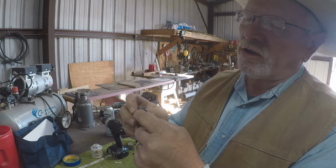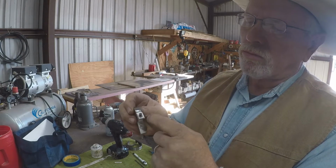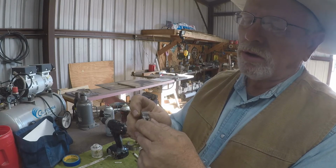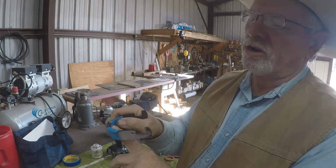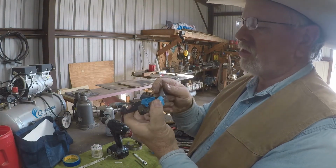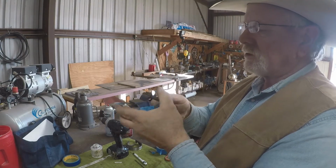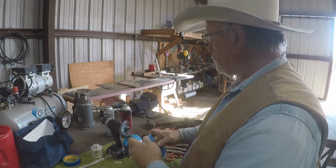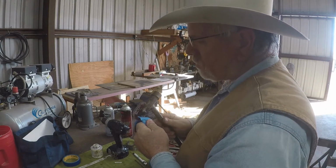I've also filed down the weld edges so when I weld my bead and then file it back to the line, I'll still have plenty of bead burned in there. I've got my band taped up here, so when I go bradding in here, I won't scar it up too bad. And then I'll put this on here. I'll tap it on there. Put me some tape right here. There we go.